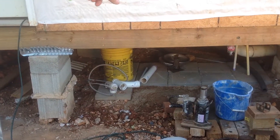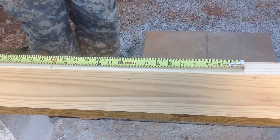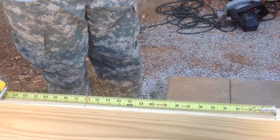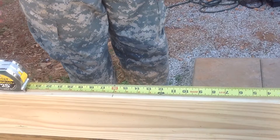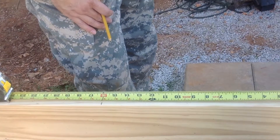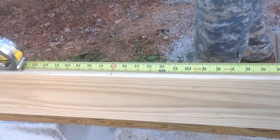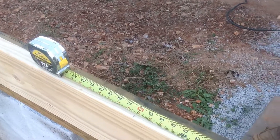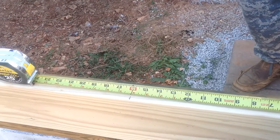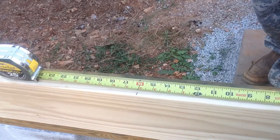I measure to make sure, and the screws on the other side are not exact, so I'm going to have to put the joist a little to the side of those screws — but that's okay. I want to make sure my floor joists are straight. Once you mark every 16 inches, you know where to put a joist. We measured our boards — they were 94 and a quarter inches. So we're going to cut all our 2x8 joists to length and then fasten them. I'm going to fasten on this side with 16D nails with my pneumatic nailer, and fasten the joist hangers with deck screws. I like to start in the center and work my way back so I'm not stepping over joists.